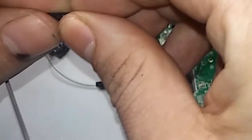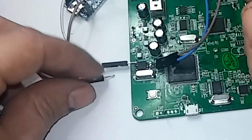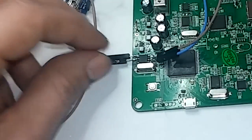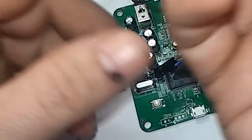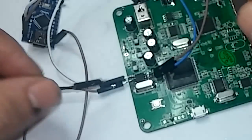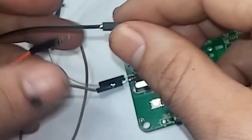And then we'll do the pin 13, which is your clock. That goes there. The next 2 pins left here on this side is your hold and your 5 volts. What I just did here was I just tied 2 together for those 2. You can just put a blob here and short the 2 out. Just make sure you know how to remove bridges, because they can be a pain.